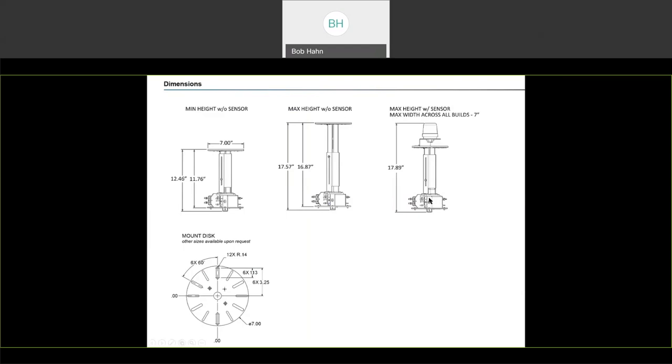Depending on the size of the globe dictates how high or low you'll have to place this. Using a 7-pin receptacle with a wireless node — we've done plenty of installations and there have been no issues with either radio or cellular communication through the acrylic of the globe — so this node can go inside the fixture and not be sitting on the outside. It's not a great place for a twist-lock photocell, so it's still advantageous to use a button eye down in the fitter area, because photocells seeing through acrylic usually doesn't work out very well.